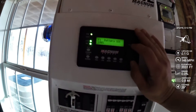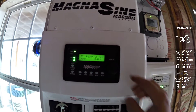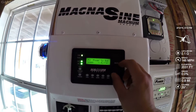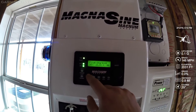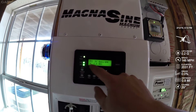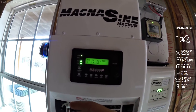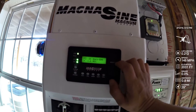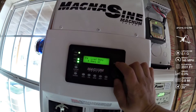In the favorites menu I've programmed: the first one shows you the state of charge of the battery; the next one shows power to the battery from the charge controller — how much you're making — and rolling the wheel tells you various features of that. Favorites F3 shows charge going into the battery right now. If it's positive, you're putting power into the battery; if it's negative, you're taking power out. It reads in amps.